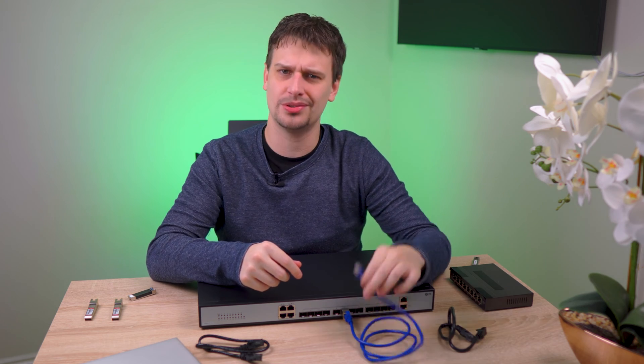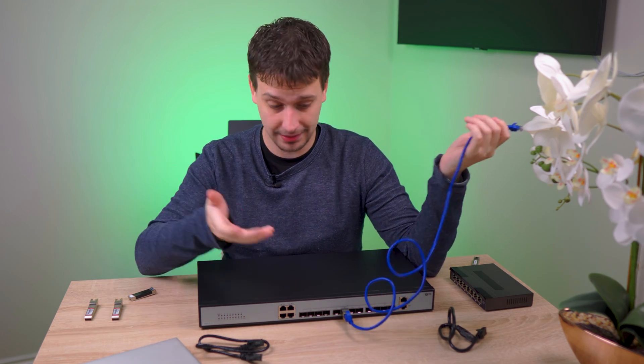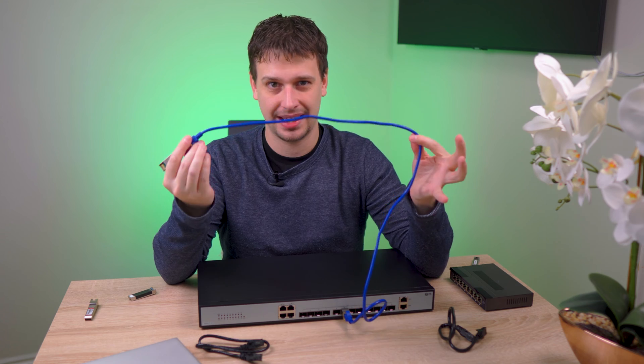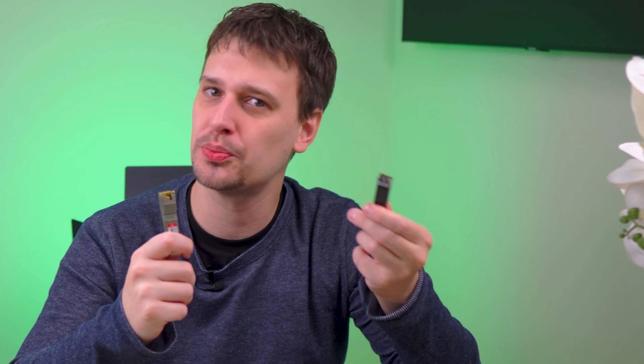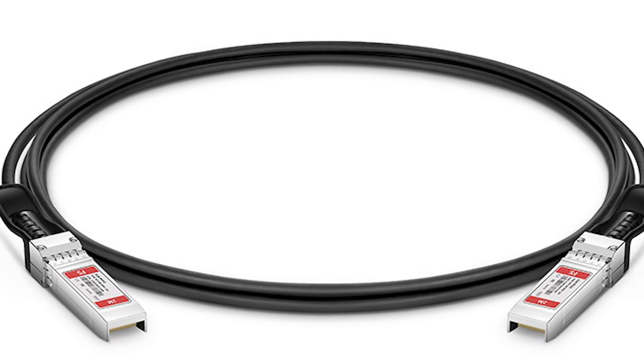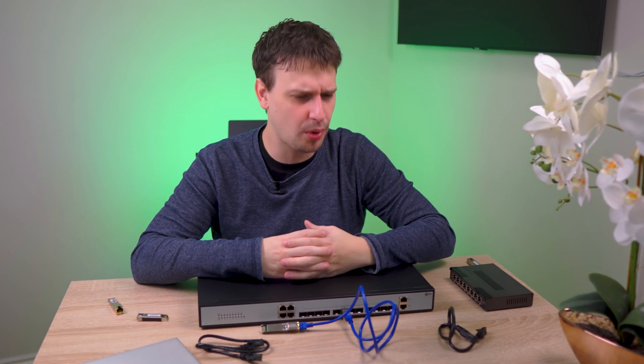I know what you're thinking — the cable is already terminated. Why have this extra step and extra hardware? Well there are real world benefits to doing it that way because the transceivers don't really care about the cable between them. This transceiver accepts an RJ45 connection, but this one takes a fibre optic connection, and this is a DAC or direct attached copper cable with SFP pre-terminated. So if you need to connect this switch to another one over a huge distance — 100 or 500 meters or even 10 kilometers — you would probably go for fibre optic because it would be cheaper and ethernet just doesn't go that far. Then use ethernet for close devices or a DAC cable for connecting two or more switches in the same rack.